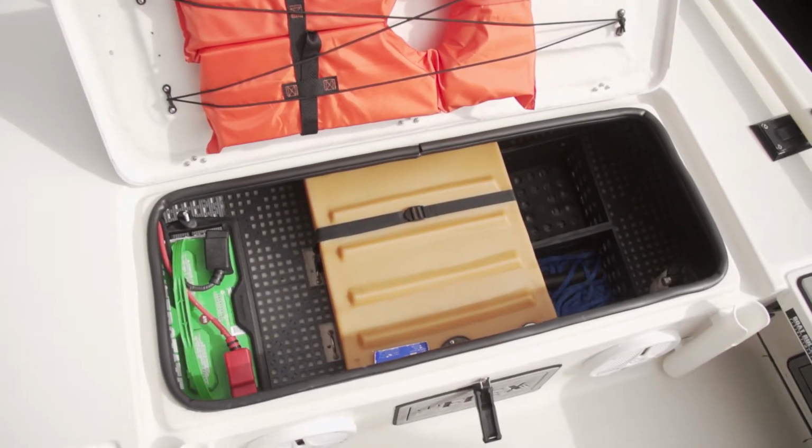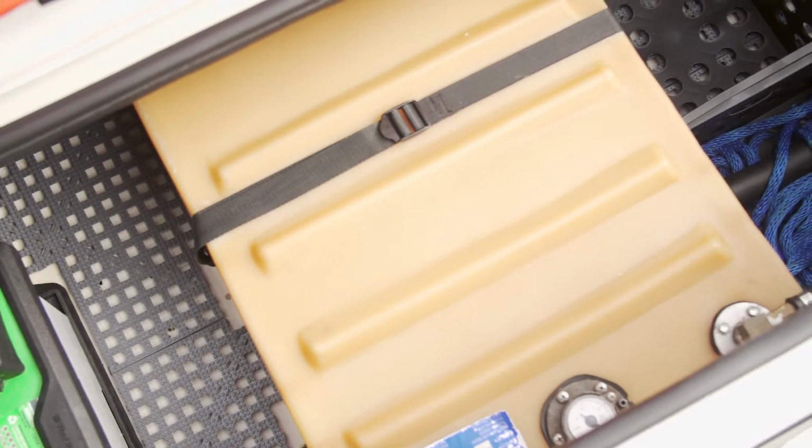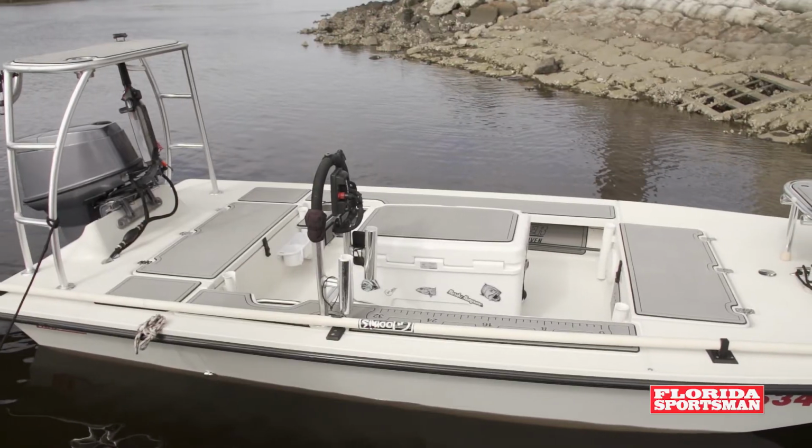All the wiring was replaced. I made a decision that I needed to add in a water fuel separator, put that in the front hatch, replaced all the fuel lines in the boat as well, and just did everything all at once. So that way, if you're in there, you might as well do it versus piecing things together. It was way more cost effective for me, and it kept the workload actually down because you're just in one place at one time.